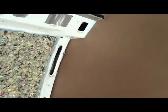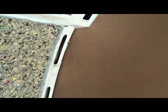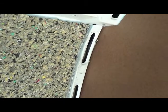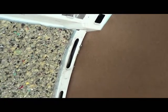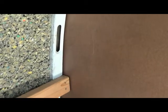I had to make some adjustments along this edge due to irregularities. I had the peel and seal that I put on underneath this foam, and it came up over the edge of that rib in locations, which made it thicker. So I had to do some trimming back there to get it to fit. So all in all though, it's in.